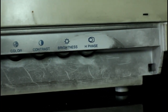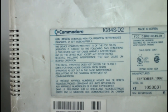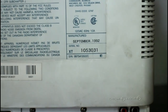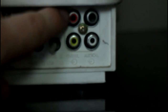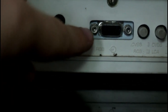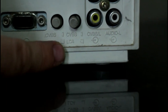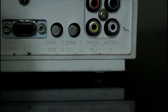Here's the backside — just more dirt, tons of dirt. There's the model number 1084S D2. It gives you some X-ray emissions warnings, so apparently you should wear lead around these. Manufactured 1992, so this is a fairly newer one. You have your composite and then the top one which is part of your Luma/Chroma — it uses composite and luma together. There's your analog RGB, and here's your horizontal size, vertical size, and vertical shift. The buttons control input switching: one down and one up was composite, both down did Luma/Chroma, and a different combination does RGB.